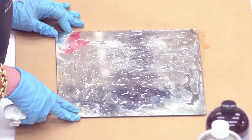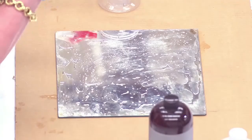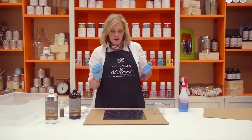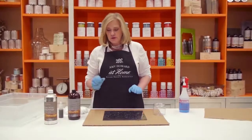I'm going to turn this over because I want to make sure that I have a nice clean surface area to work on. You'll notice the mirror is wet. If you're working on a large piece, it's perfectly fine — you can use a hose outside to clean it. Don't forget to use the Simple Green before you use the water from the hose. Remember, now that we've taken this back off, the mirror is very susceptible to scratching. I want to keep my fingers away and respect the fact that I'm getting ready to antique it.